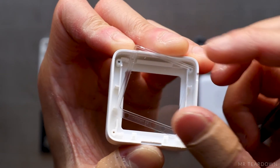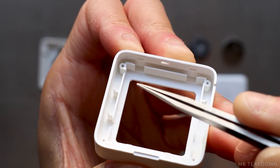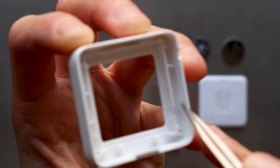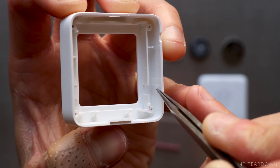And finally, the acrylic can be removed from the enclosure. Taking a closer look at the inside of the enclosure, you will see these seemingly useless cutouts on the rim. They are there in front of each of the 6 snap fits to allow the mold to back off from the snap fits before the plastic is ejected from the mold.